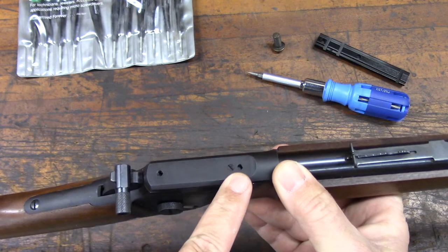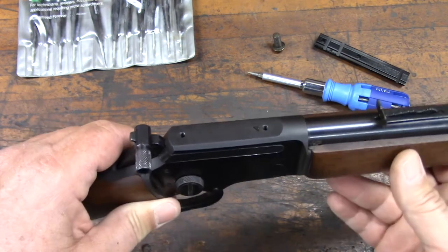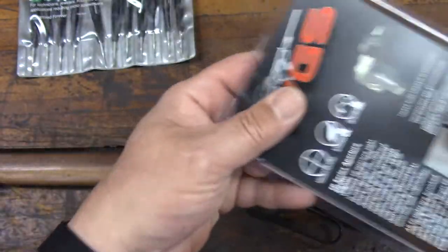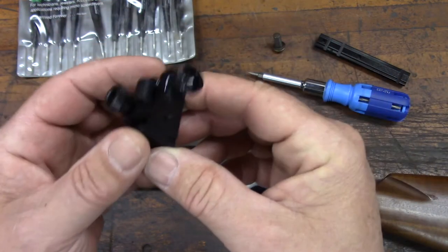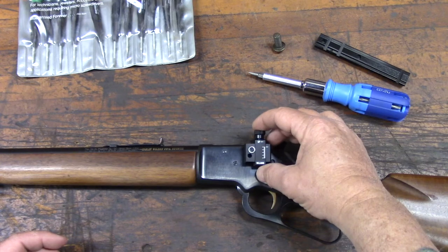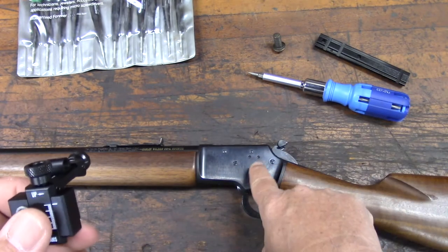You can see there are two empty holes where the mounting screws were. There's a third hole and that's got a filler screw in it. I don't know what happened to the original filler screws for these holes — you can buy those from a gunsmithing supply place like Brownells or Midway. So before we go any further, let's take the Williams Foolproof receiver sight out of its packaging and just confirm that it is the correct rear sight for the job. Here is the rear sight — you can see it's got an elevation knob and a windage adjustment knob. It's going to mount onto the left side of this receiver. We need to make sure before we start drifting out the factory rear sight that the mounting holes are going to line up with the mounting holes in the receiver.